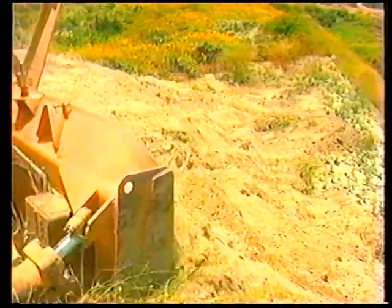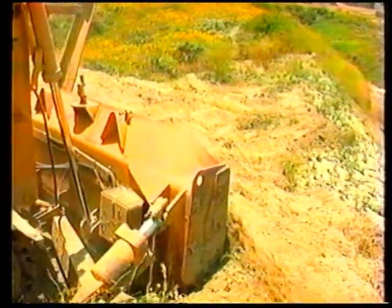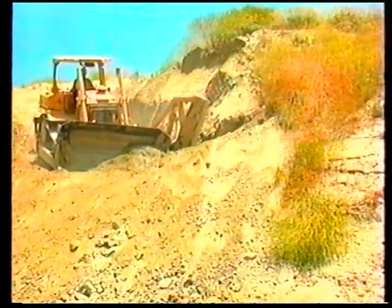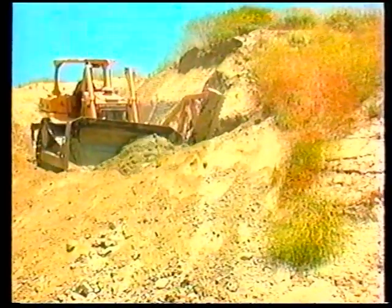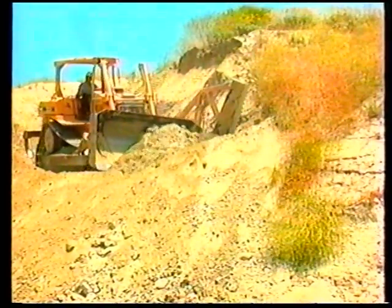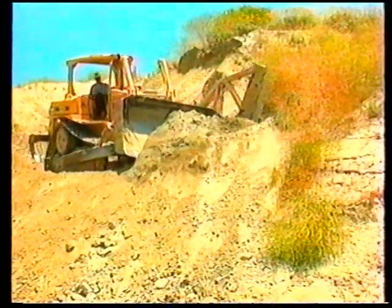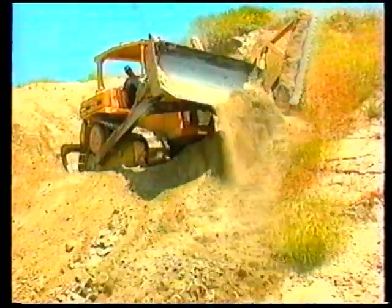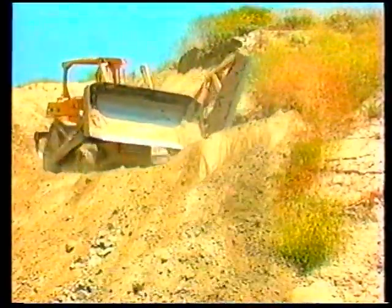Pioneering can be a challenging and sometimes dangerous task. The operator should be experienced with operating a dozer, and only the most experienced operator should pioneer in steep hillside areas, especially in rock. The machine that is to be used for the task should be in good working condition, with the tracks in good shape and properly adjusted, as access for a maintenance vehicle can be limited or impossible.